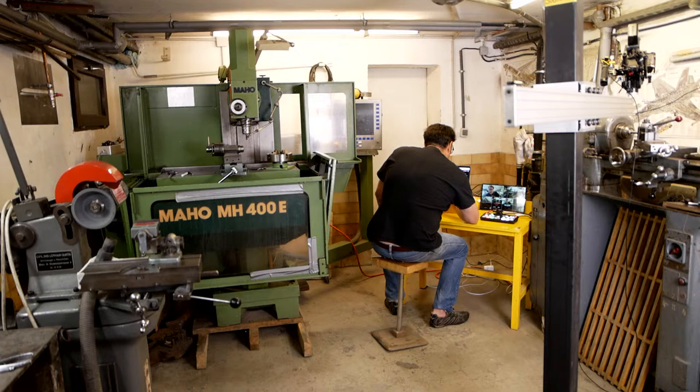Yeah, not too bad. No rotations left on the insert. I'll have to have a look. Yeah, I think it was just tugging the part. Now it did definitely take out some of the collet, but luckily these collets are not hardened, so it's fine. Teeth left on the saw? No, not really. Insert's trash.